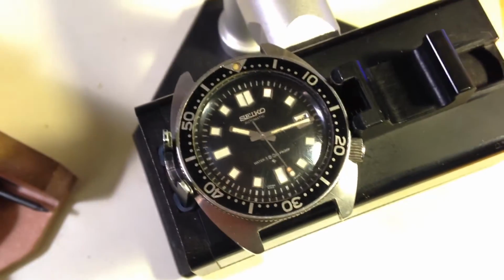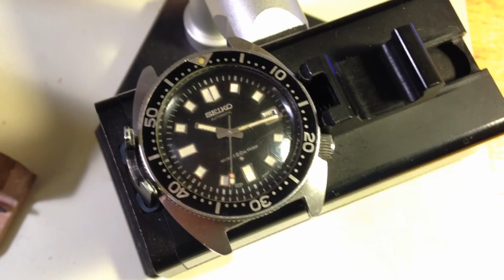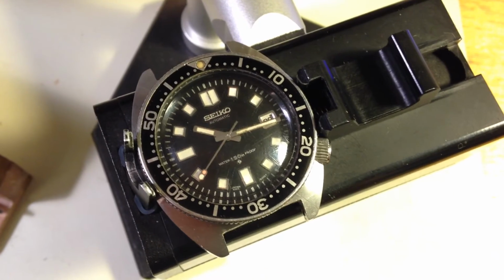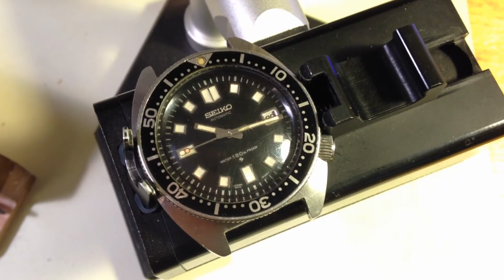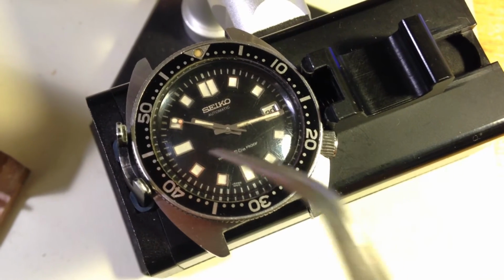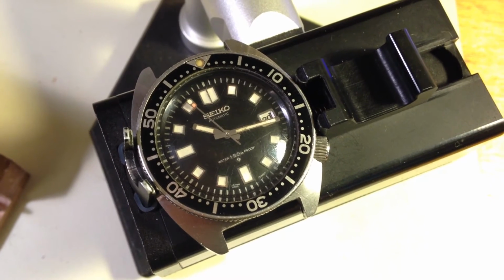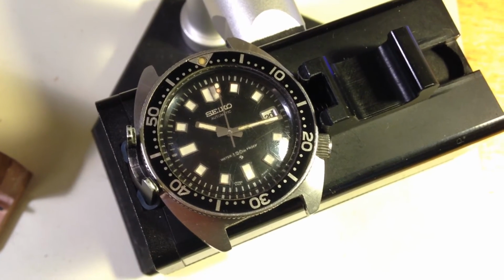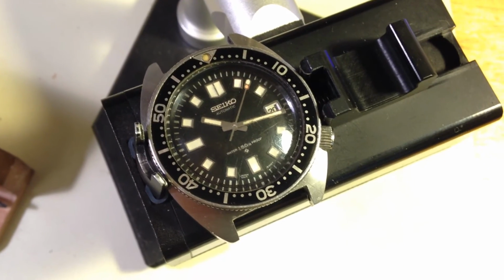Now this watch, when it was new, would have been equipped with what we now call a Type 1 crystal. Seiko, this crystal is a 320W10GN00. Seiko made at least 4 iterations of that crystal. My good friend and business partner, Jonathan Koch, who sadly died last June, was the first person to identify the fact that multiple different crystals for these were made, and he went and reverse engineered them from original crystals and had them recreated. We now own these designs, and we're the only people in the world that have them made because he passed his designs and trademarks onto us.